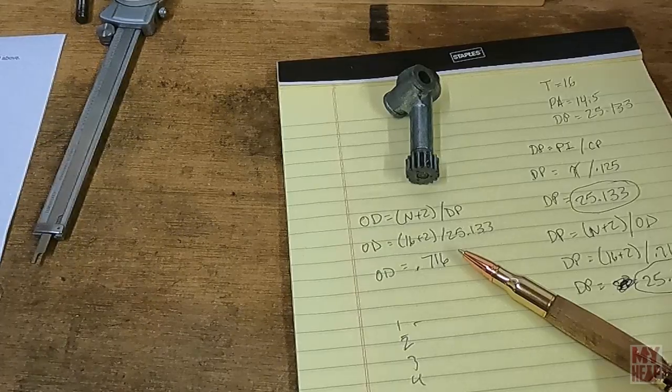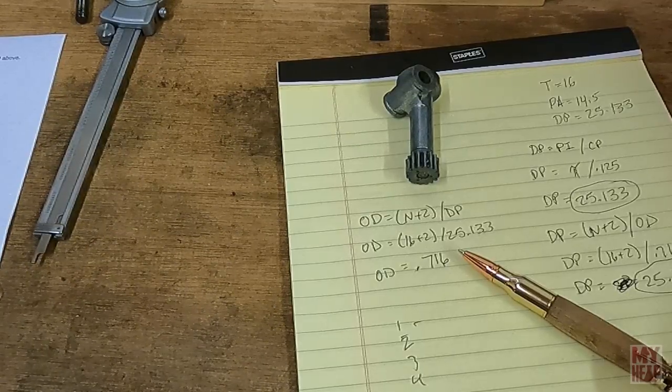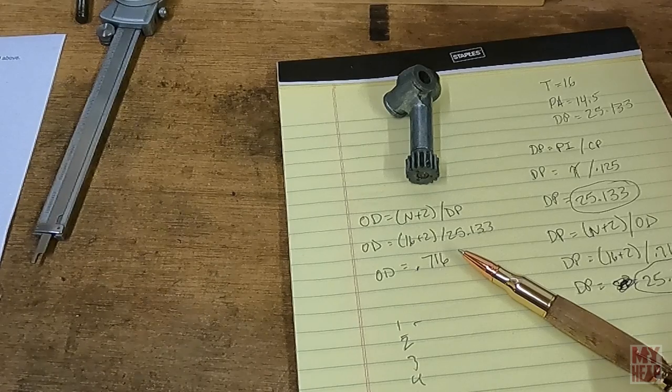If the calculations are confusing or you'd like me to explain them differently, just drop questions in the comments. I know that was a lot of detail on the thread gear and dial, but when gathering information for Ben I became a little intrigued. Think about this: when driving the saddle along the lathe, the thread gear acts like a spur gear rolling on a round rack. And when you're cutting a thread and waiting for the line to line up on the indicator, it's acting as a worm wheel driven by a worm. Anyway, thanks for watching — if you found this video helpful please consider liking and subscribing, and have a blessed day.